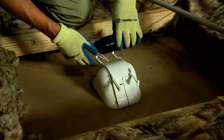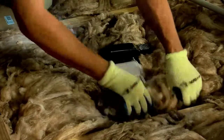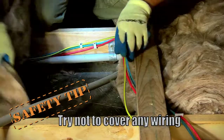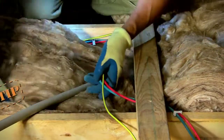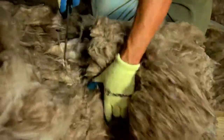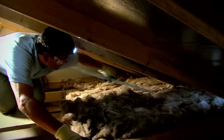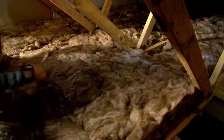It's comforting to know that earth wool will never catch on fire. Regardless, try not to cover any wiring as it may overheat and fail. So lift all cables and push the insulation under them. Use all of your offcuts to fill any voids, or areas where the joist spacing is wider than the insulation. And make sure you've got a good snug fit wherever two ends butt together.